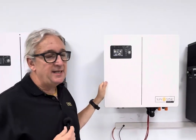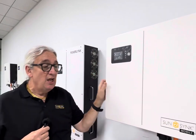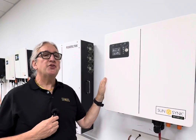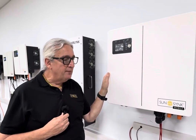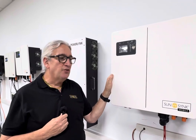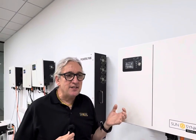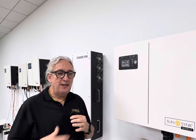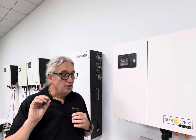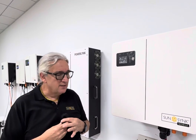Going a bit further here, this is the 10 kilowatt — 10 kilowatt IP65 — using the new UI. One thing people say is, well, it doesn't have a generator port. No, it doesn't. However, there's a simple adapter: you plug it into the load connection, it splits the load, so you've got a separate load and it gives you a gen port. It's not an expensive add-on. On the gen connector, it actually gives you clean changeover contacts for your ATS, and it gives you everything. It's a very simple install — you just connect onto your load, it goes onto your box and splits it, so you've got a gen port and a load port. Connect your generator and you're not fiddling around with settings. You've got a simple changeover relay, so when it wants the generator, the relay changes over and it'll operate the ATS.